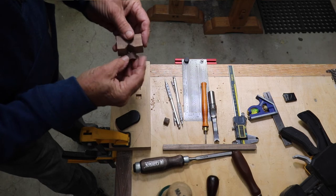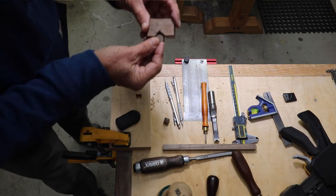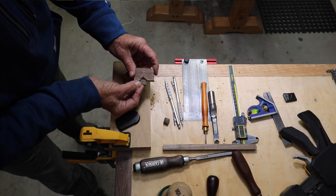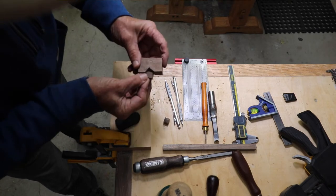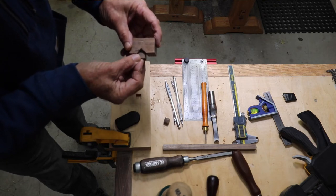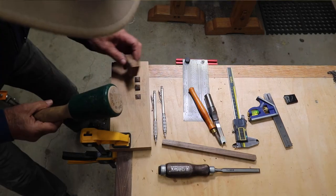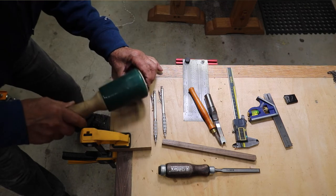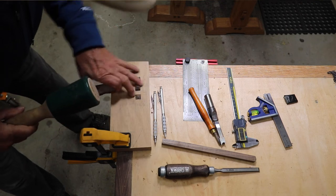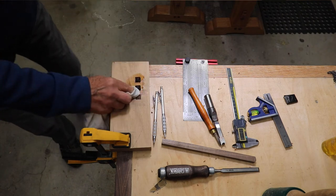I got this idea for a pounding jig from Matt Jackson, Next Level Carpenter — I'll put a link to his video below. Take a piece of hardwood and in the cross-grain direction cut little angled notches that will be a half inch across in my case, and taller than my pyramid plug. That way when I pound down using this as a pounding jig, I will not deform the top of my pyramid plug, and it also won't go down too far because I create the jig so that it bottoms out at the right depth.